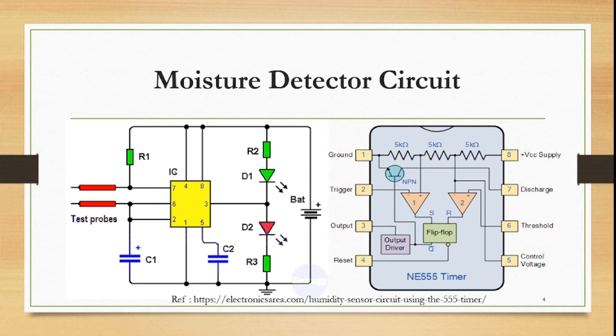To explain this, we need to study this socket. This is IC555, operating in astable mode. This astable IC555 has a socket where RA, sometimes called R1, is the resistor. There is a virtual resistor between the two probes, which we call RB, and capacitor C, here called C1. As you know, the astable multivibrator has a frequency F = 1.44 divided by (RA + 2×RB) × C. This produces pulses that turn on and off.